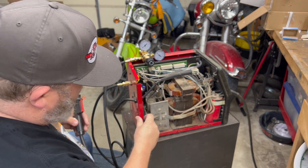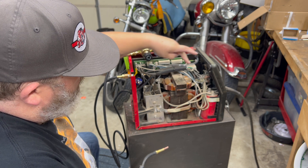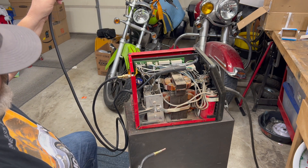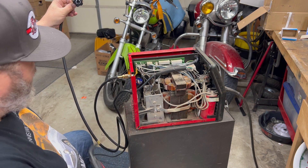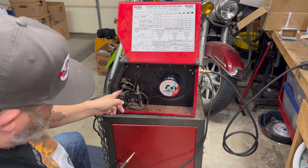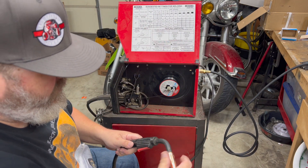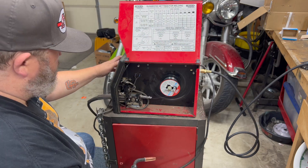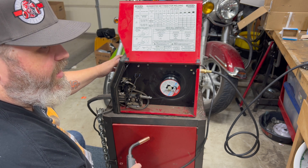We have our solenoid installed and the wires wired — again, non-polarity, not a huge issue. We have our argon hose plumbed. Something they never show you in other videos is what goes on after here: this will go onto your argon tank, 75% argon 25% carbon dioxide — open that up, it goes into here, and your hose goes into there. We now have our polarity changed for the torch. Since I'm going all MIG, I've decided to put all new consumables on here and start fresh. I'm gonna turn it all the way down, turn it on, and see if that solenoid clicks — if so, we're in business. Just gotta get an argon tank and then lay down some pretty welds.